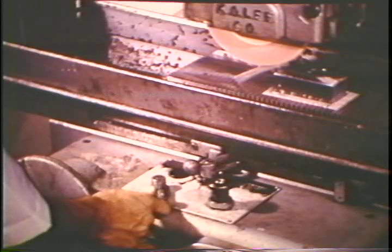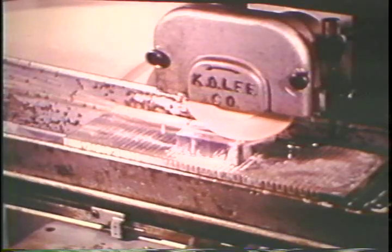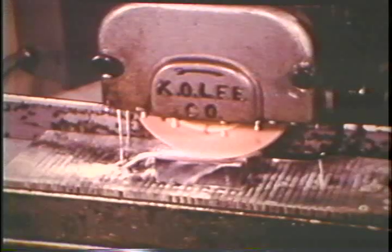Remember, this is plunge grinding, so the crossfeed must not be moved. Rough grind the work to within 1/1000th of the specified depth. Finish grind the workpiece. Don't forget to let the wheel spark out on the last pass.